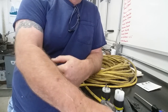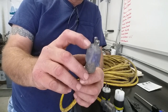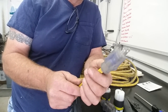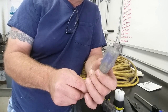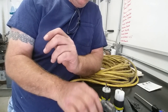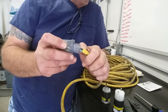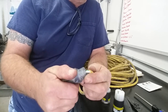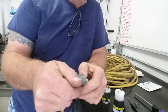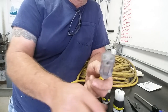GFCIs are supposed to take care of that, but on a construction site there are any number of hazards. Here's a hazard — either someone tore that out with a pair of pliers, we've got the ground pin missing on that one. So this was taken out of service. That was a pretty decent molded plug — it's got an LED in it to tell when we've got power — but still no ground. Here's the other end: this molded plug pulled out of its insulation and now we've got wires that are getting kinked right in here.